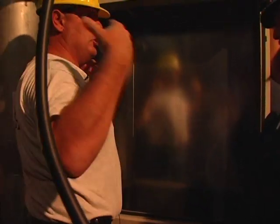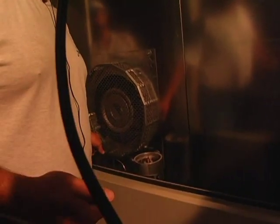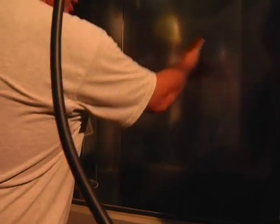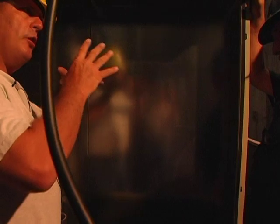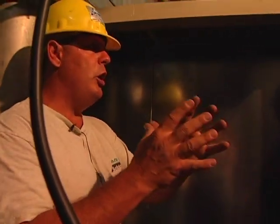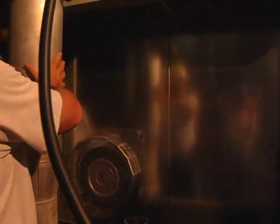It's not going to blow your ears off. There's also an unloading valve in here. The unloading valve is set up so that when we start the unit up, the air is going to unload — that silver piece right over there. The air will unload, meaning pressure is fed directly to the atmosphere, into this area. Once you develop a certain pressure over a certain amount of time, that valve will slowly close so that your air is directed into your outlet.